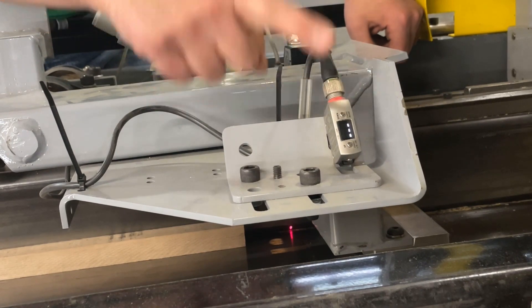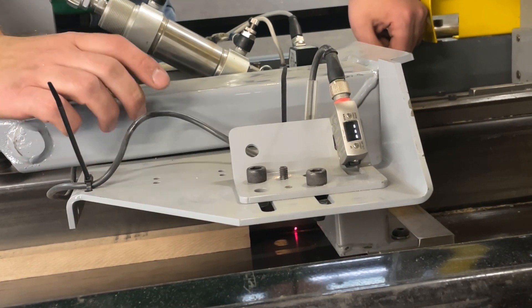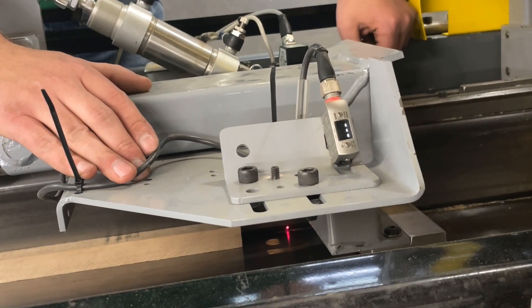Keep in mind, the sensor may also be in a location where it will be seeing top down onto the table. That gives more sensitivity for thinner stock, but less sensitivity for bowed stock, where it may see the end of the board before it actually reaches the end because the board is bowed away from the fence.